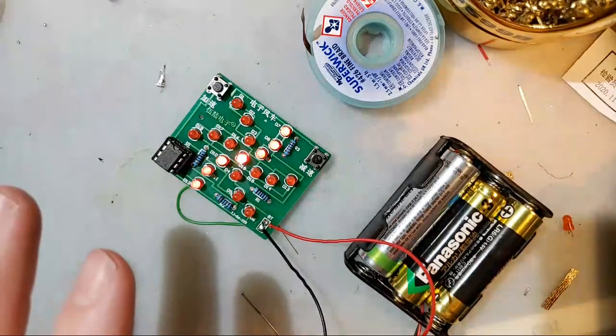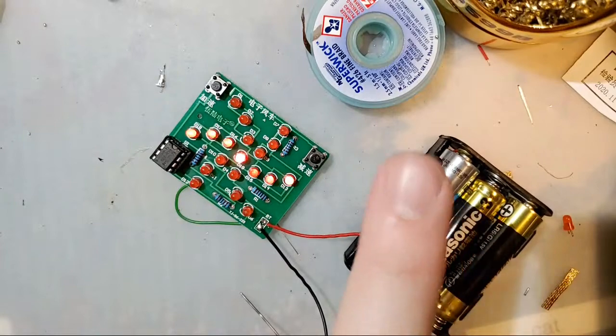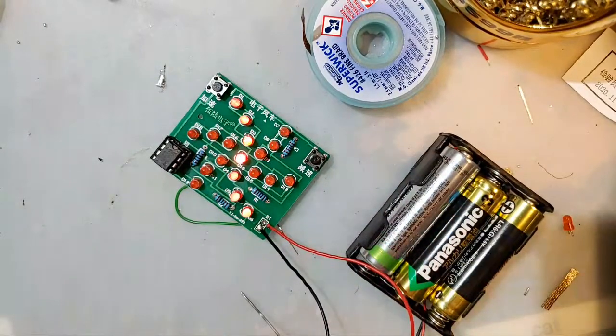My only concern with that one is if your batteries are a little bit lower and you have an IPS kit and you're using a flash cart, it could peak a little bit higher than 500 milliamps, and that might pop the fuse. I believe the stock fuse is 1.25 amps, but they're a little bit over-spec'd. Actually, it depends. The Game Boy Color uses two different fuses, so I don't know which one you're talking about, and it doesn't matter because I don't know which is which offhand.